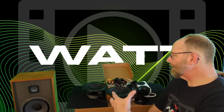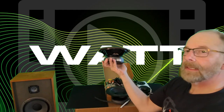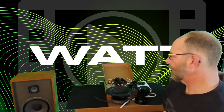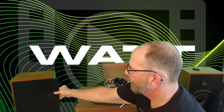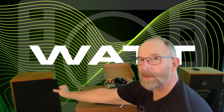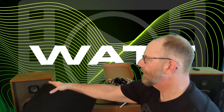I've got all my parts laid out here. First, the woofers — I've got the Dayton Designer Series DS215-8 woofer, two of these, one for each speaker. I also have acoustic felt — it's an eighth-inch thick, comes in sheets, and it'll fit perfectly in here after a little trimming. It'll cut down on some of the noise coming off the tweeter and the higher frequencies from the woofer right there on the front of the baffle.